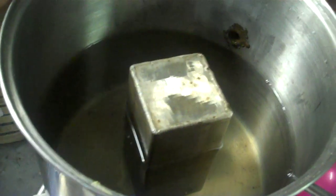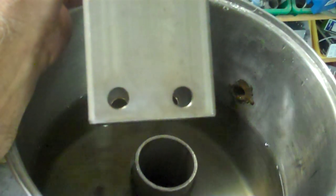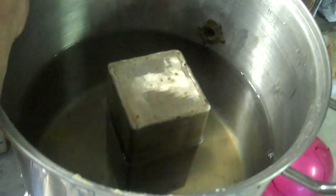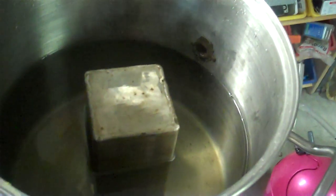If I'm running this thing like a plain Jane thumper, you know how you just basically charge your thumper to the base or to the top of the outlet holes on the bubble cap, just enough to get some condensing, so you get some phase change. When I finish the run, it stays pretty dry. There's not that much liquid in it. But when I'm introducing forced reflux, especially when I'm trying to make clean liquor, the liquid volume does fill up. That's the whole point, to get the thing to actually fill up, to load it, if you will. So anyway, that's the inside of the thing.